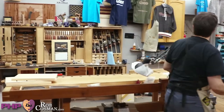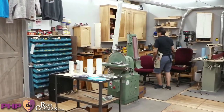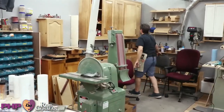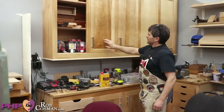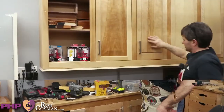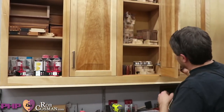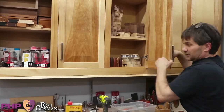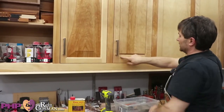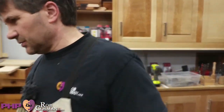And by the way, solid wood doors, if you think of that as well, over here we've got two doors, I have solid panels. This one is fielded. This one's not. But that solid panel is prevented from cupping because there's a narrower tongue cut on the end of it that sits down into a groove inside this rail, top and bottom, and that prevents that from cupping. So not hard at all.